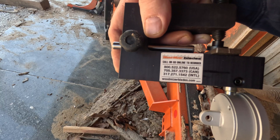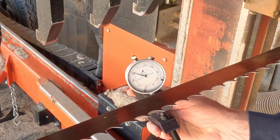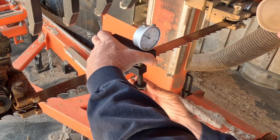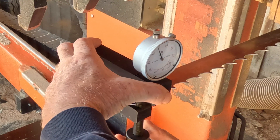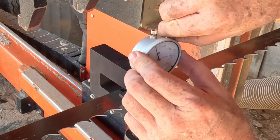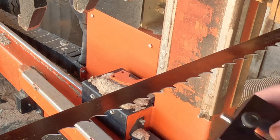So this is what this gauge looks like. The first thing you have to do is set the zero on it. You go to a neutral tooth, put the gauge on top of it, slide it over, open up the clamp a little bit, slide it over, and put that indicator directly on that tooth. Then you zero it out. It's extremely important that you do it on a neutral tooth, and also extremely important that you do it on both sides of the same tooth.